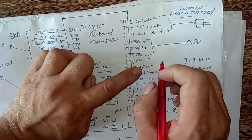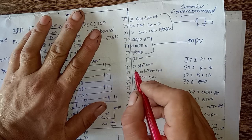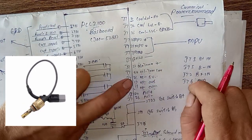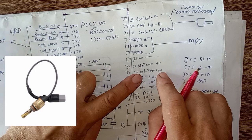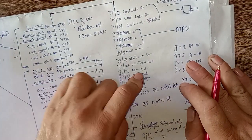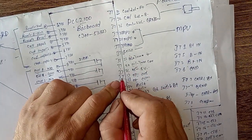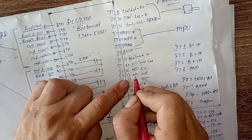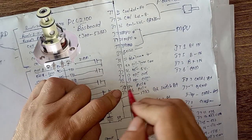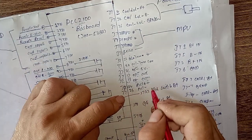J7 pin 30 is the sender power for the temperature sensor. J7 pin 32 is oil temperature power (positive), J7 pin 26 is oil temperature common, and J7 pin 21 is oil pressure input — meaning oil pressure sensor supply. J7 pin 13 is oil pressure sensor output, J7 pin 17 is oil pressure common, J7 pin 24 is actuator positive, and J7 pin 28 is actuator negative.